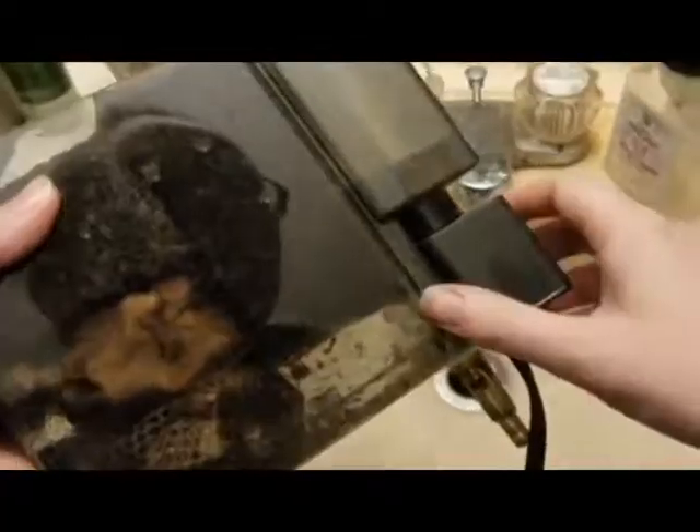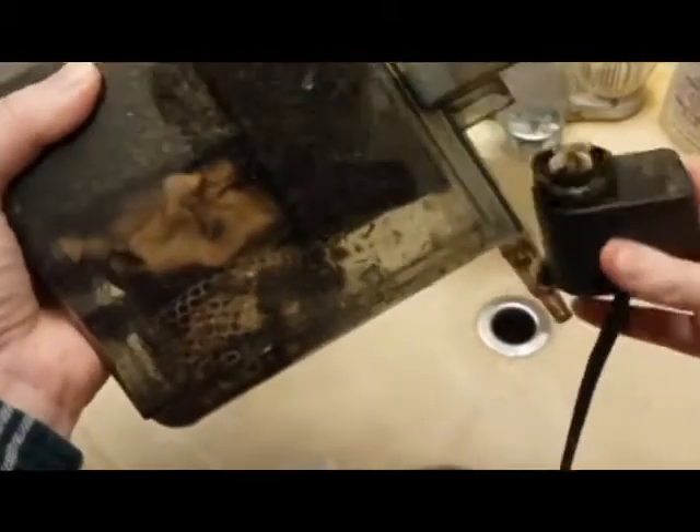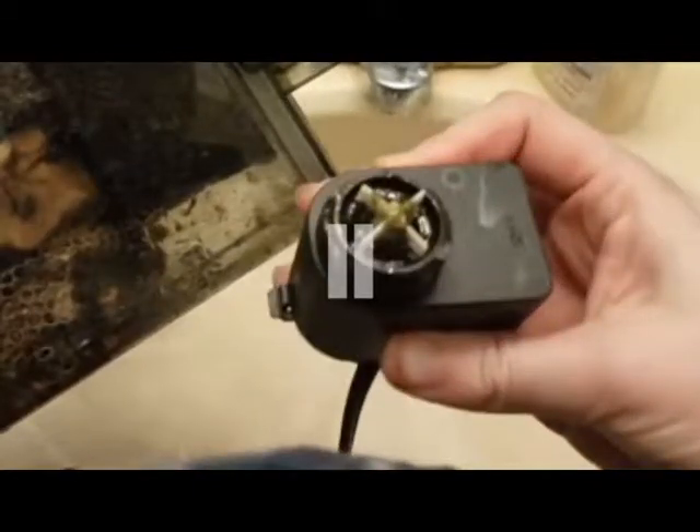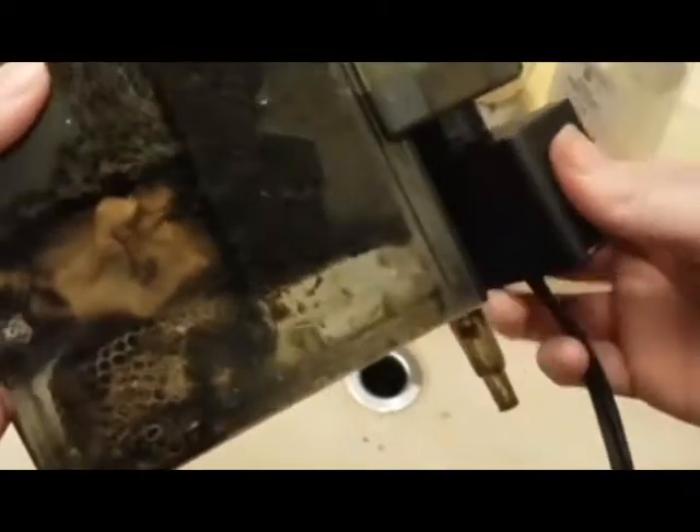Another important part is your impeller, and if you have one of the brands that I mentioned before, all the pieces come apart. You can see the algae and the things that are trapped there. Just fling it out, get a toothbrush, scrub it, rinse it, screw it back on.